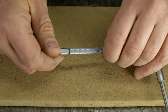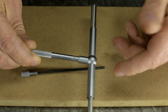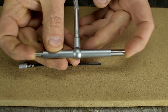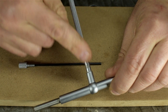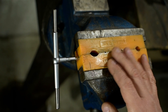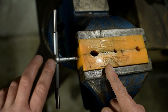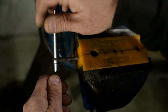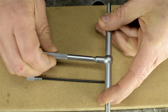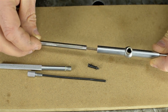Start in the back with the screw. The handle on these Brown & Sharps threads from the head. Put them in a vise with soft jaws — rubber or urethane — and break the thread locker without bending the handle. Don't unscrew it all the way; hold the plungers while you unscrew the handle, as one of the two may try to take your eye out. Inside you should find a little spring-loaded pin — that pin is what keeps the anvils from shooting out.